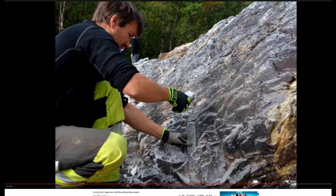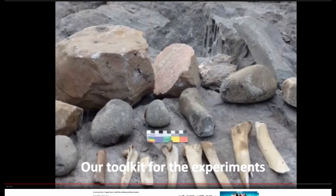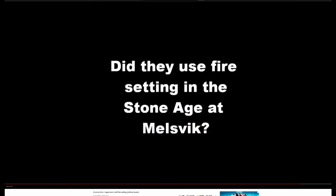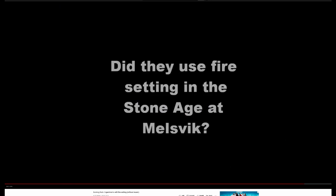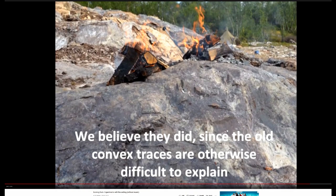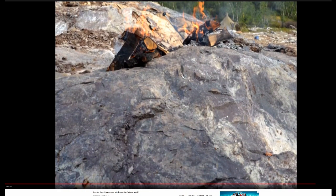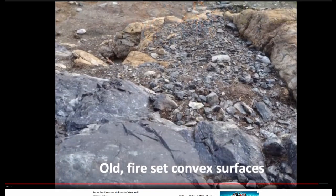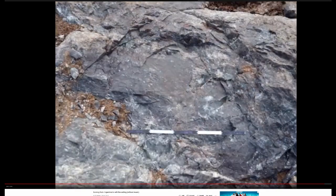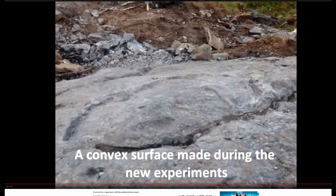Granite is a great material for some features, but it is absolutely hopeless against fire. It's much stronger than limestone and sandstone, but limestone and sandstone are far better at withstanding fire. A small fire and your granite building is structurally compromised. That's one reason why you really shouldn't use granite too much — it's a more beautiful stone but it's not always the superior choice for construction.